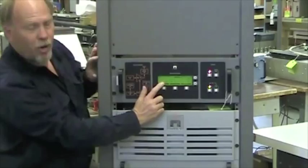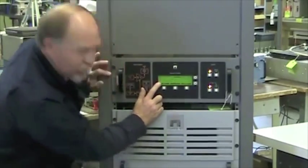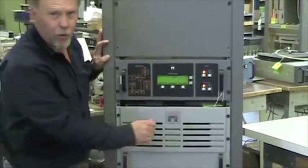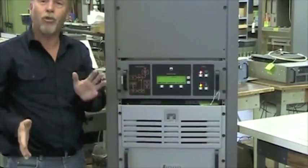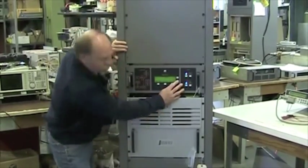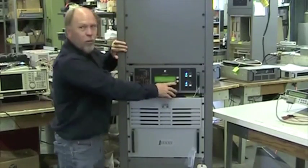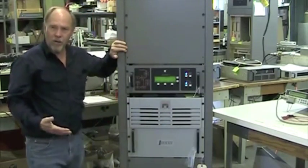With RF turned on, the first meter is an average B+. At 0 power, that should be around 150 volts. It does take an average from the 2, however, both of them are about 150. The next one is a total DC current. Right now it's 0. The next one is a VSWR. We're not trying to produce power, so it's at 0.00.